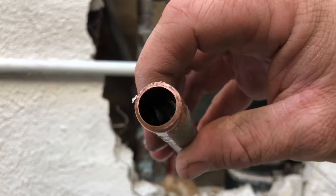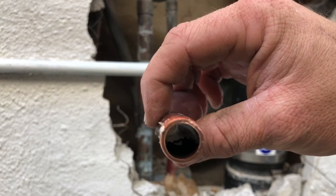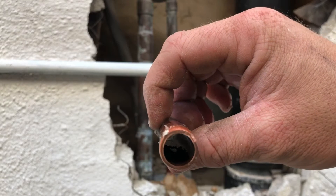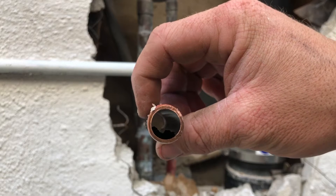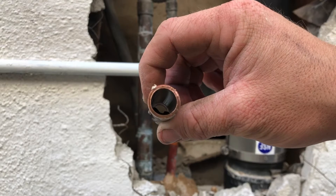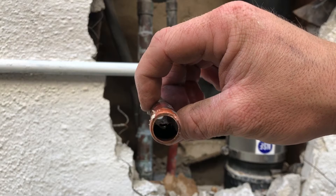Right here I'm trying to show you the inside of a pipe that has had a pinhole. It's like a weird little mound that begins to form on the inside. The chemical chloramine has accumulated there — it's stuck to the side of the pipe with the hard water and begun to eat its way through. What you're seeing is basically a chemical reaction on the inside, slowly deteriorating the copper from the inside out.